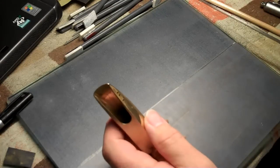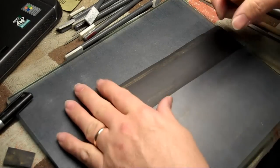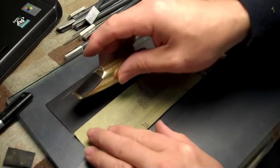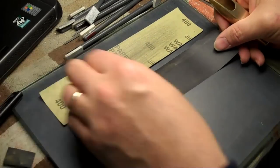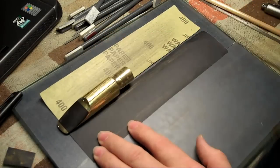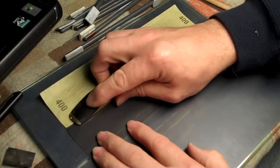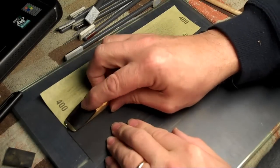The bump — since it's minor, I like to use a specific approach. If it's major you can just lean one way or another, but if it's a minor bump, try to make sure you cut more on the right than the left. Lay down two strips of sandpaper — I got that backwards, always good to double check. I'm going to move my lighting so I can see my mark a little better. I also know that leaning just a little bit off level is where that bump is. You can look at it to see where the scuff mark is to make sure you get in the right spot.